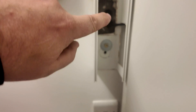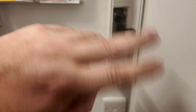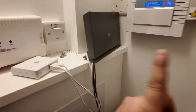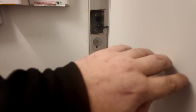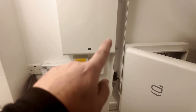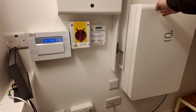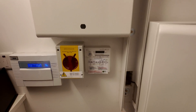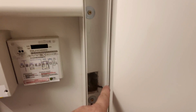We need to tie this into the Sigenergy store. We're bringing through the Cat cable which links the gateway and the Sigenergy store. We also need to take another Cat cable through from the router to the Sigenergy store so it's got data, and then we've obviously got our power going to the Sigenergy store from the gateway, and then the gateway linking up with the consumer unit. You can see there — the gateway mounted up, door shut.